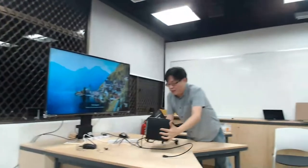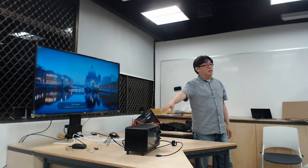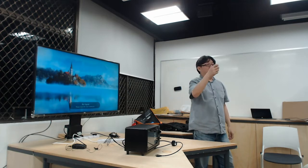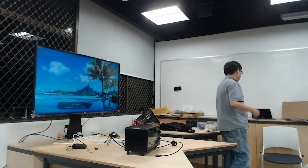It's from Giant. The only thing I actually modded about this oven is that I removed, or shorted, the timer. If you need to turn on the timer just to reflow, it drives me crazy because the thing goes tick tick tick, and I'm sitting right next to it. So I removed the timer.